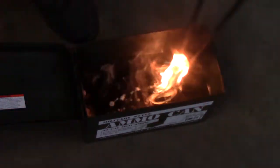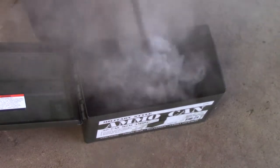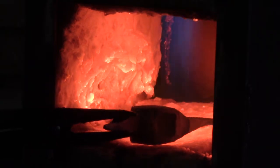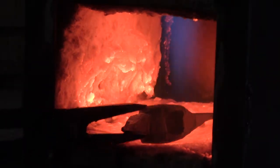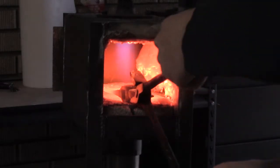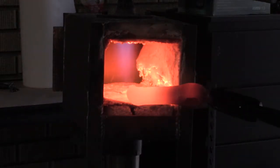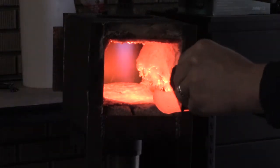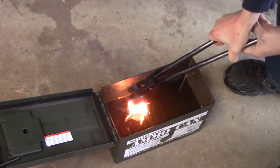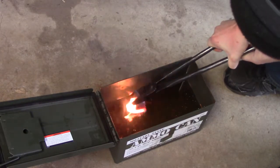This got the temperature up to almost 300 degrees. By the time I did my three normalizing cycles with the tomahawk, it was perfect — about 145 degrees. With normalizing, I'm just taking all the stress out of the steel from forging. If the magnet doesn't stick, that's critical temperature — that's where I want it. This is after the third normalizing cycle, doing a slow quench.